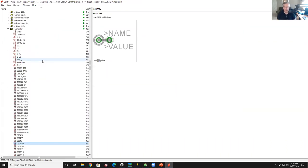And by the way, when you talk about a discrete component like a resistor, in a library, you don't have a specific library element for every value of a resistor. So, you know, resistors come in like 100 standard values from 1 ohm to 10 mega ohms. So if there's 100 different common values of resistors, you don't have 100 resistors in your library. You have one of a certain size, like you have 1/4 watt through-hole resistor. And then you put an attribute on that resistor called value, where you tell it this is a 10K. So the symbol's the same. So that doesn't junk up the library.